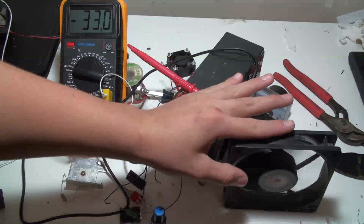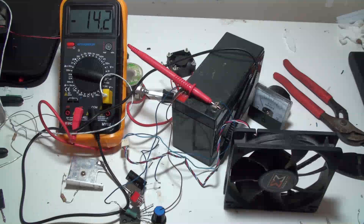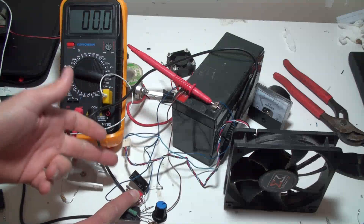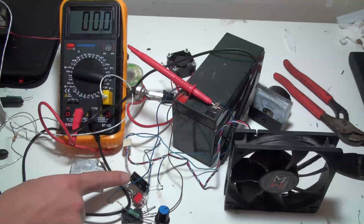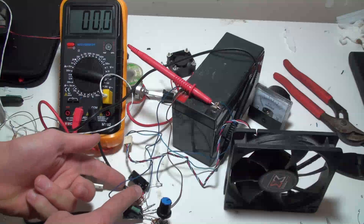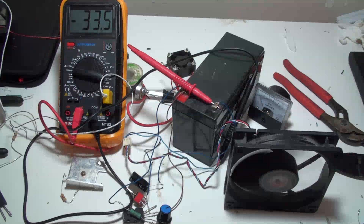Now remember what I was saying about these things not being able to start with low current? Well, here if I toggle the switch off, that charges the capacitor, and as soon as I turn it back on — and remember these MOSFETs stay at 12 volts, so this is going to charge up to 12 volts, not 7 volts or something lower than this can start at. So if I turn this back on, that will turn back on as well and jump straight back up to 30 milliamps.